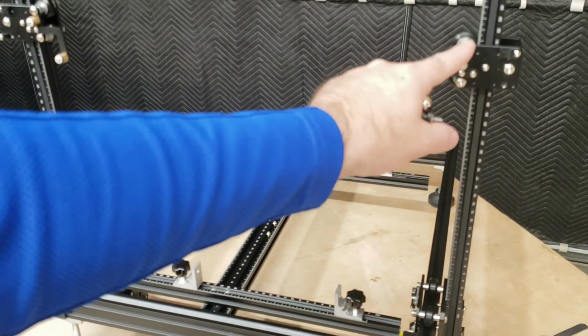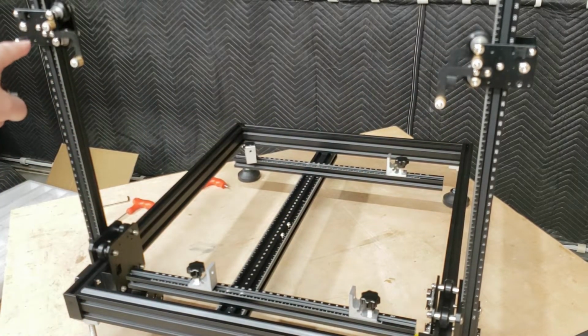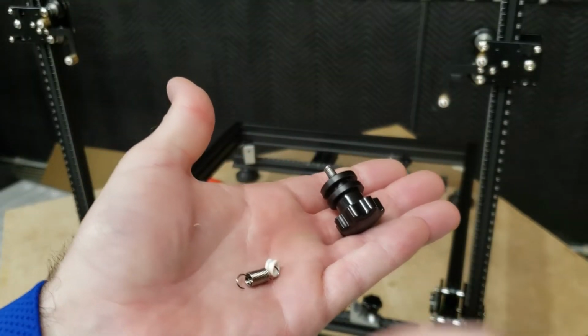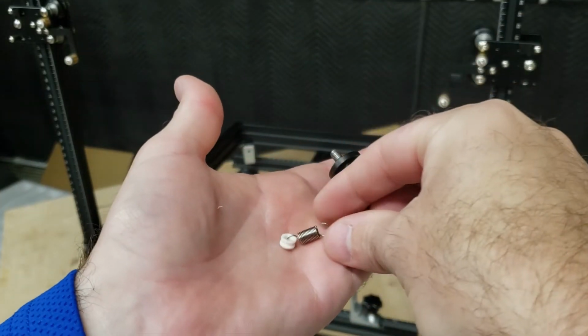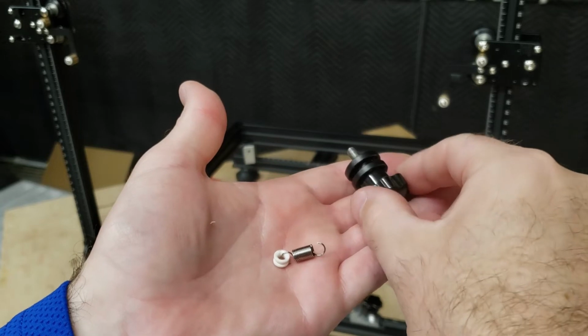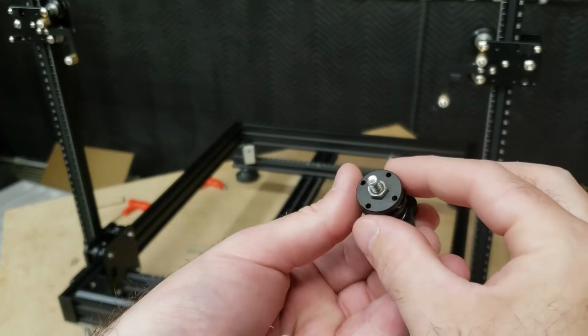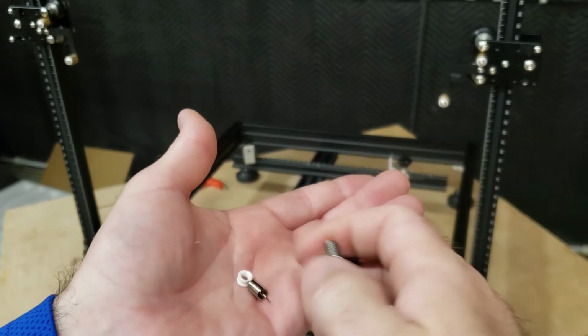It's going to route over this one, under this one, under this one, over that one, and to a spring using a second piece of ceramic over on that side. And these are the 2 pieces that we need. So the ceramic I've already installed onto the spring here, and this piece, which has a few little holes in it, is where our hot wire is going to route through and get tied off to this spring and to this ceramic.